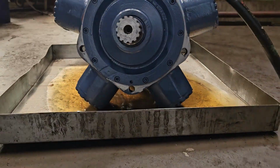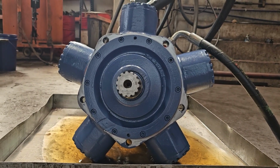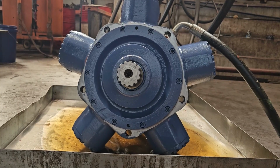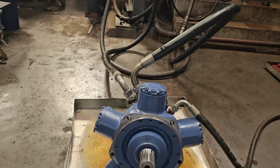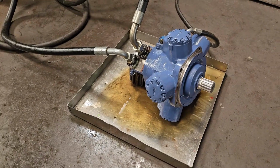At the same time, we also check volumetric efficiency by comparing rotation of the motor with flow of oil. Hydraulic mechanical efficiency and volumetric efficiency are displayed in real time in percentage. While testing on load, we also read leakage of oil and compare it with increasing pressure.